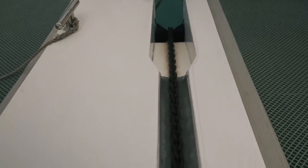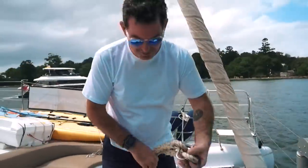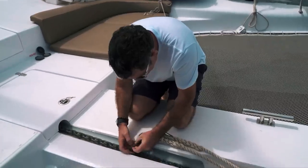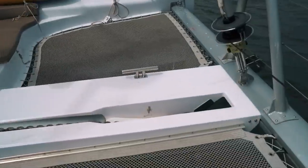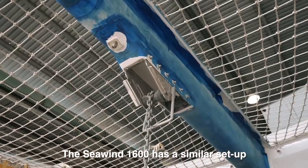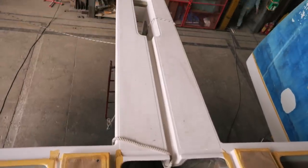The bridle gives you stability and security while at anchor so you're not stressing the gypsy. That system has to be easily retractable and stowable. If you go back to the videos of the 1260, the bridle on many other catamarans just hooks over the guardrail at the front — a workable but inelegant system with a lot of clanging around. This box is designed to make the solution more elegant: the bridle system stows neatly inside, and the Sarca anchor is designed to fit in there as well.